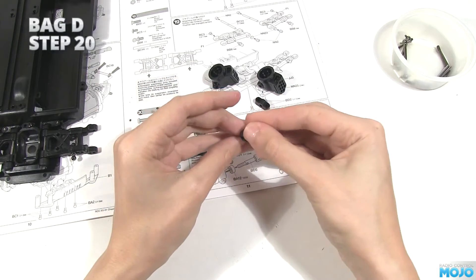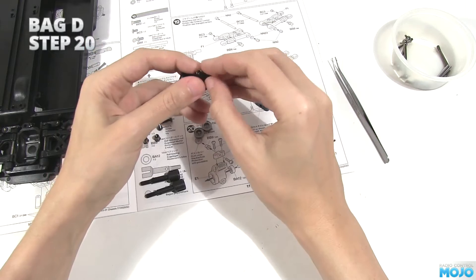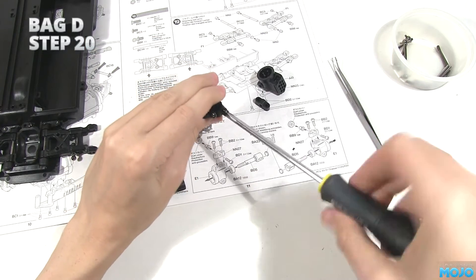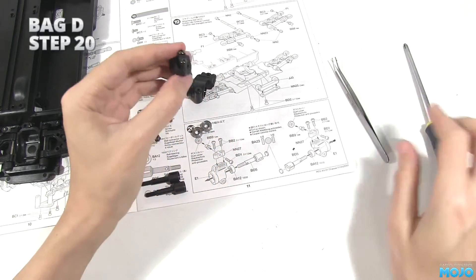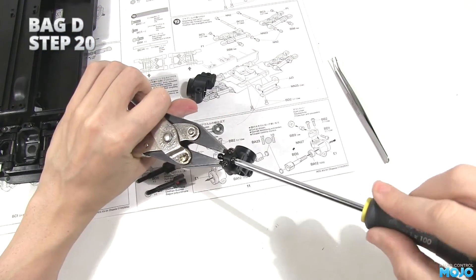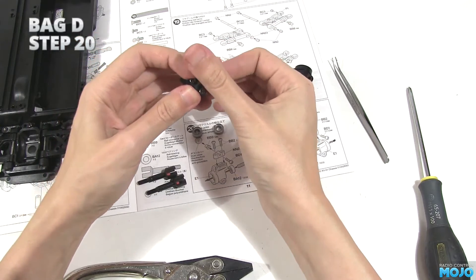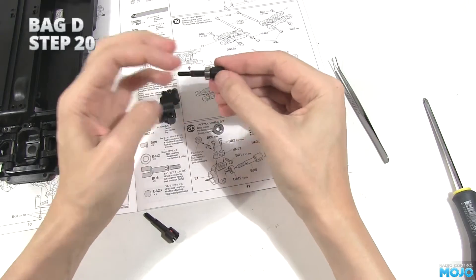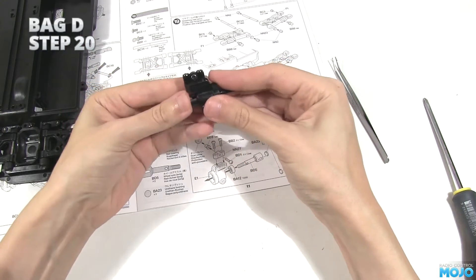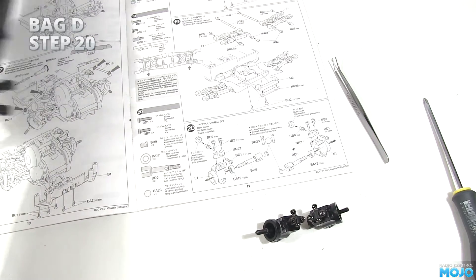Grab one of the stub axles and put one half of the bush into the cup with the cut face down, and repeat with the other one. We need one of the hubs and a trunnion — line the trunnion up on top of the hub; the holes will only match up with the centre holes. Fit two of the 10mm screws, then make up the other hub in just the same way. Now we're going to make the two hubs sided. Pop one of the 12mm screws through the trunnion and fit one of the ball nuts on the end, do it up nice and tight. For the other hub, do the same but put the screw in from the other side. Pop one of the bearings over a stub axle and press it into the hub — if you keep the parts parallel it should slide in nicely. Do the same with the other hub. You also want to fit some of the foam dust covers — you can do it now, or wait for me to notice, because I forgot.